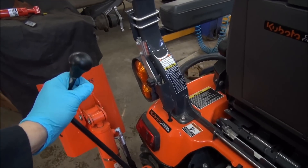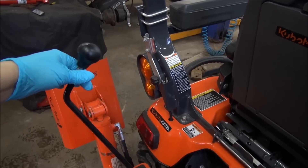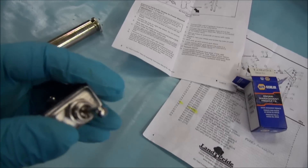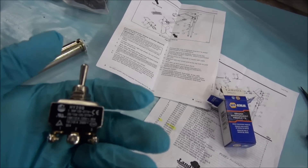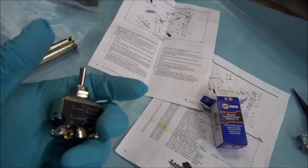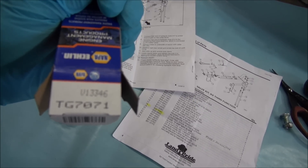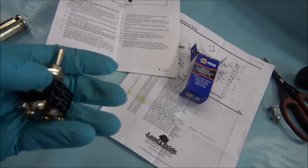It's going to be a momentary on/off/on switch, and I'm going to either machine or fabricate a holder to put the switch on so I'm just holding on to it and hitting the button to operate the thumb. Seeing I'm not going to use that $450 switch, I'm going to use a momentary on/off/on switch. For anybody looking for that switch, it's a NAPA number TG7071. It should work well and I'm just going to make it look better.